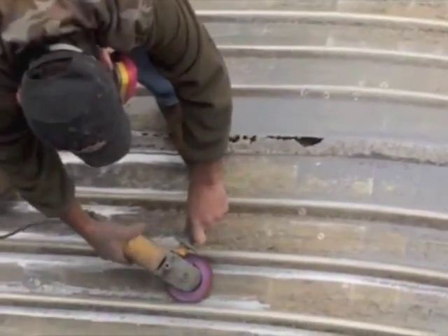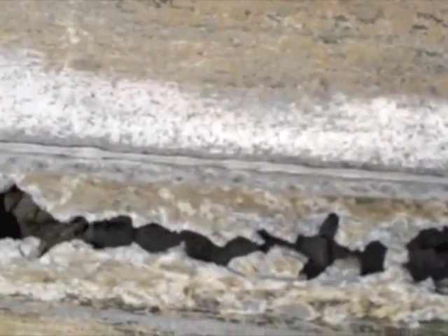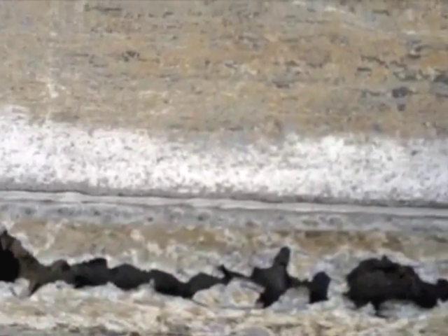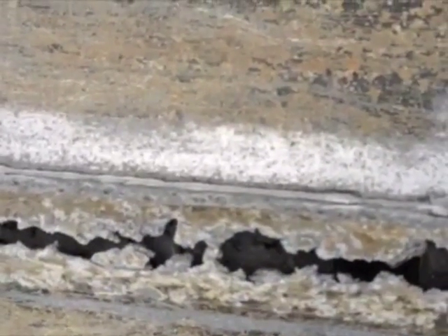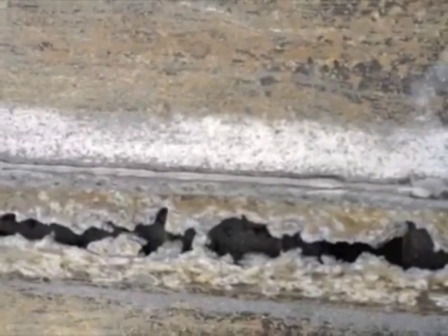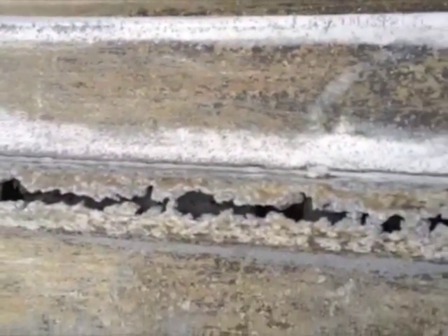What a mess. What we have here is a certifiable mess. You can see the metal is in pretty good shape over in the main part of the boat. However, when they build these boats they stamp them in two halves, and the two halves are joined by welding this extrusion in the center. Whether it's inferior quality material or whether welding changes the molecular structure, it creates a weak point, and when left in salt water this is the first place that goes on aluminum boats.